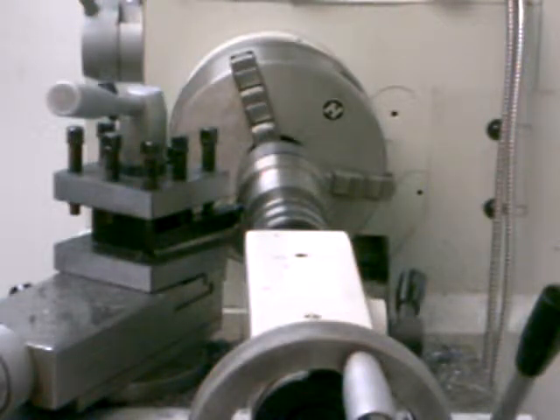The first item that I'm going to work on here in this next project — and it'll be a series, I'm not going to do it all in one video — but one of the features that some of the so-called gunsmith lathes have is what they call an outboard spider, which is simply on the outboard end of the spindle. They have four set screws — they're brass tipped — that you can use to hold the other end of a long barrel, such as a rifle barrel.